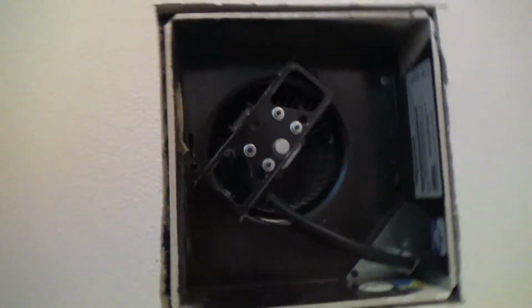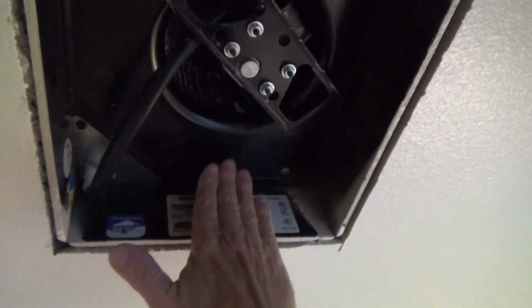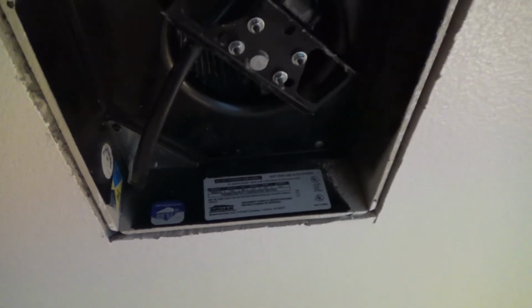And incidentally, if you do that, usually there's a housing, this housing is deeper, and then there's a tube with a little fan paddle that flops out, and that's for your exhaust, and then it either hooks into a little exhaust pipe that goes up through your roof or down to an eave or something. And the thing I was going to say with that, some are 3 inches in diameter, while others are 4 inch. So you got to crawl up there and make sure you know which one you get, because if it's a 3 inch vent, you want to make sure that your pipe size coming out of the new one is 3 inch.